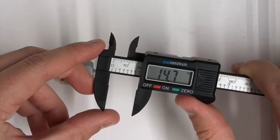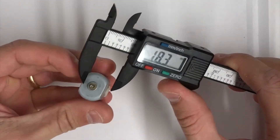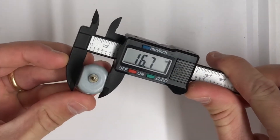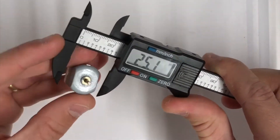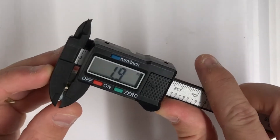We're making use of some digital calipers to take a few measurements on the motor itself. While I will be taking a number of different measurements, the principal measurement I'm most interested in for our 3D print is the shaft. We're going to take a measurement of the shaft and it's going to measure at about 1.9 mm in diameter.